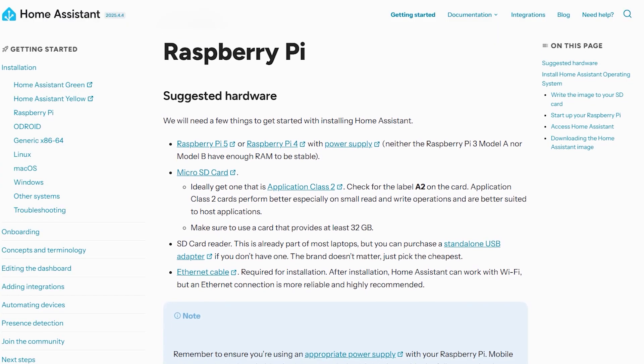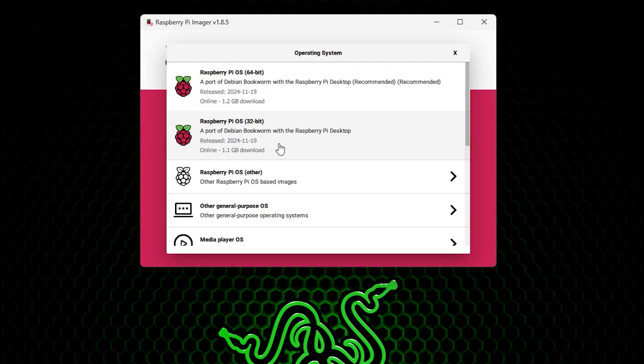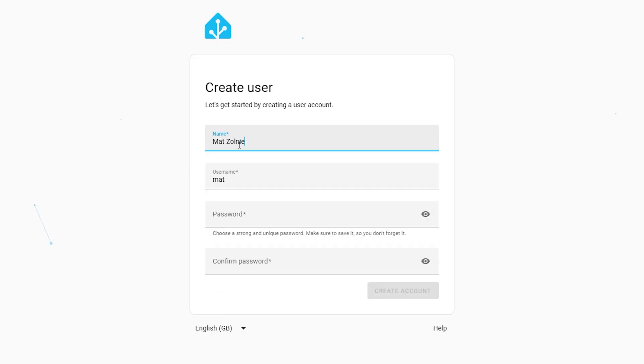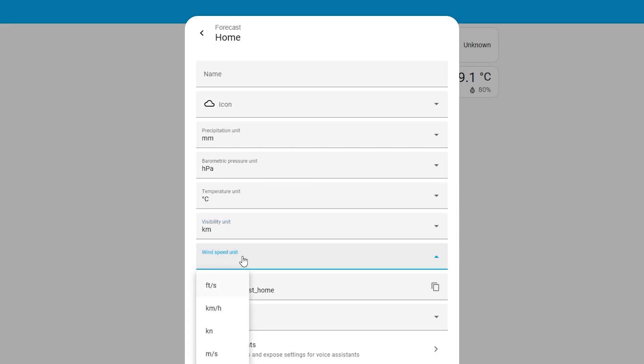You'll need a Raspberry Pi imager and an SD card of your choice. I'd strongly recommend something at least 32 gigs or bigger because Home Assistant needs a little bit more space, especially if you're interested in adding more functionality down the line. The process was super simple — burning the SD card with an image just requires you to click next a couple of times. Once you pop the card into the Raspberry Pi, it takes approximately 5 to 10 minutes to set everything up, and then you'll be greeted with the Home Assistant dashboard or web interface, available at homeassistant.local on port 8123. This is exactly how you're going to be interacting with your automations through the web browser. There is also a dedicated app you can download on your phone, so whether you're using it from a computer or your phone, you're fully covered.